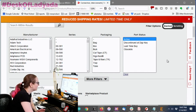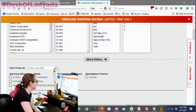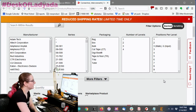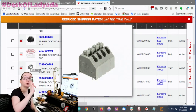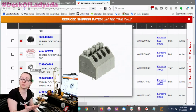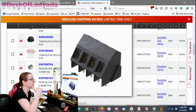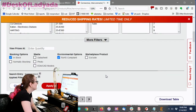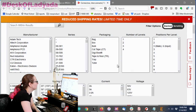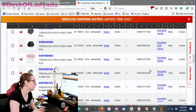Next, apply 'active items only,' 'RoHS compliant,' and 'in stock.' You can scroll down and see different styles. For the RGB matrix FeatherWing, we need a two-position terminal block. One thing to know: terminal blocks are often only available in two- or three-pin sizes because you can slide them together. Every brand has a slightly different notch for sliding — you can't mix and match brands. Pick one brand and stick to it. I once got a mix of two-pin from one brand and three-pin from another, and it was a mess.